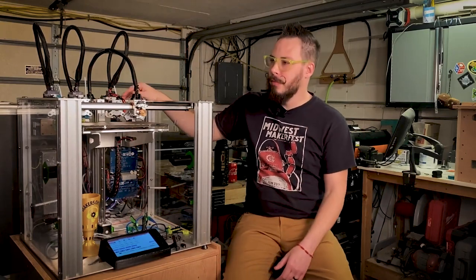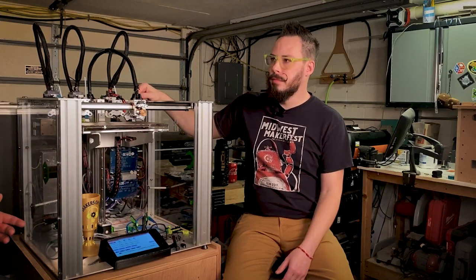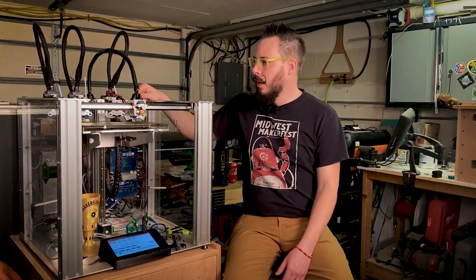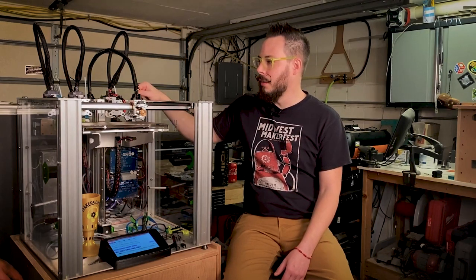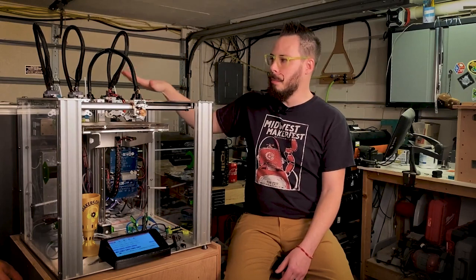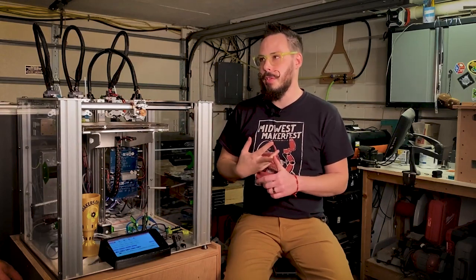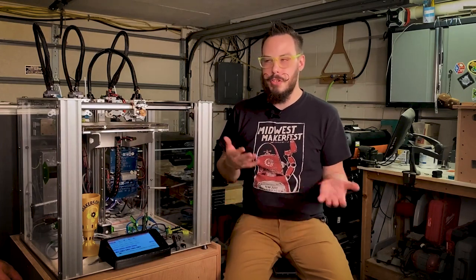Okay. Well, with people adding a whole bunch of different tool heads and stuff like that, what are the print temps that it can get to, to be able to successfully print those kinds of materials? What kind of materials? Like I said, it's a build-it-to-your-spec machine. When you buy the E3D kit, it comes with a tool head that has an aluminum block, a brass nozzle, and a standard thermistor. So you're limited to 300-ish C at that point.